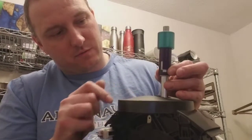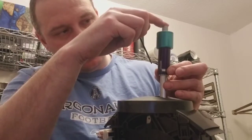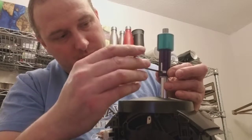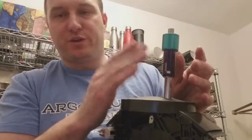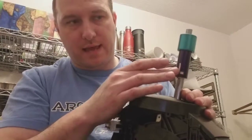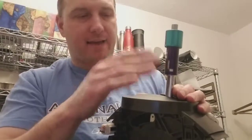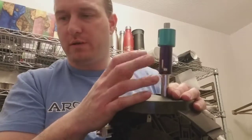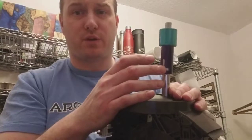You're going to want to press this down about an eighth of an inch, just so that the little plastic button in there is pressing down just a little bit. When you do that, turn around and tighten this up. When you're setting this up for the first time, don't put any Loctite on there. But when you're ready to put it in and use it all the time, you should put some Loctite in there. The blue one is good, or the red one — the red is pretty hard to get off after, so maybe start with the blue one.